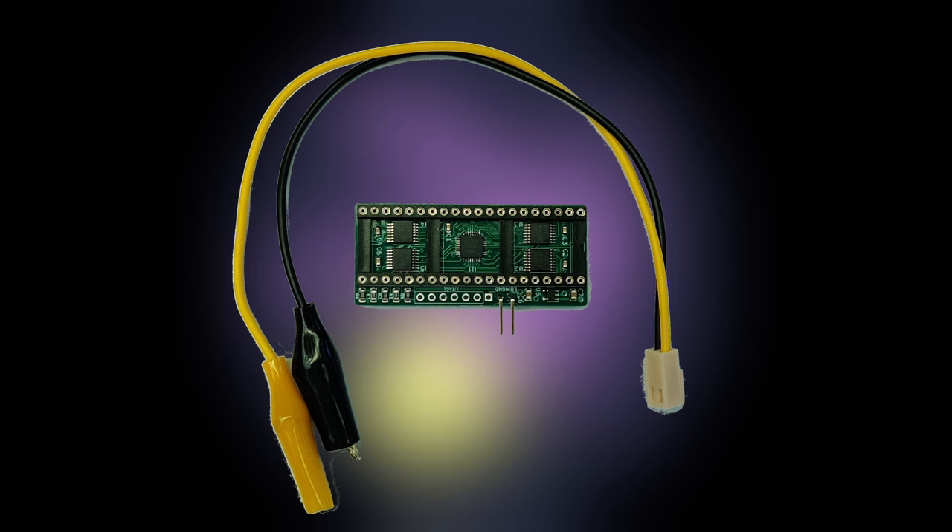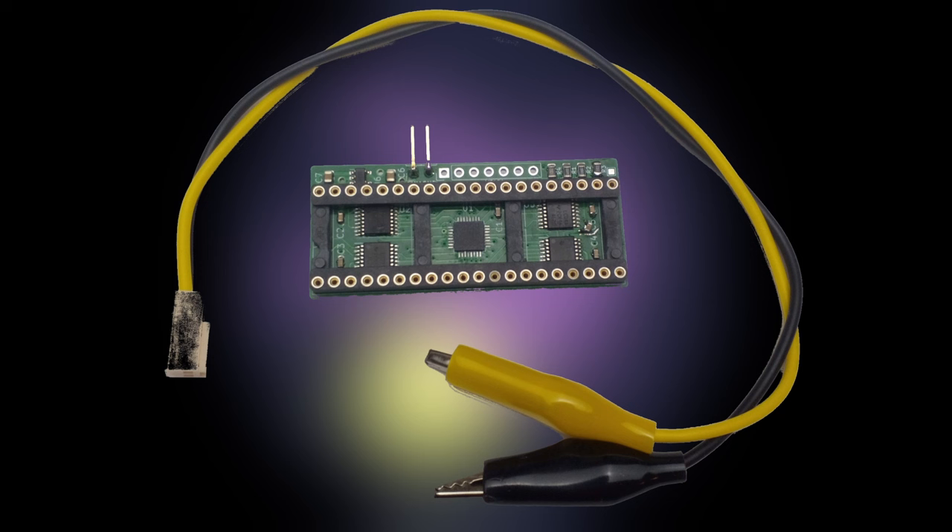This board will work on all Atari 8-bit machines that use the GTIA chip. It may also work on the earlier CTIA since they were pin compatible and produced similar output, but I don't know of anyone who's tried that yet. Commodore is also well represented. The VIC-II Dizer works with the VIC-II chip and the C64. This version is capable of auto-detecting the type of VIC-II chip you're using, with the exception of the early 6567 R56A variant — in which case you need to request a special firmware when ordering — and works with either NTSC or PAL machines. I'll be installing one of those later in this video. I've heard that there may be some issues using this in conjunction with the VIC-II Kawari, but I haven't tried that, so I can't confirm.